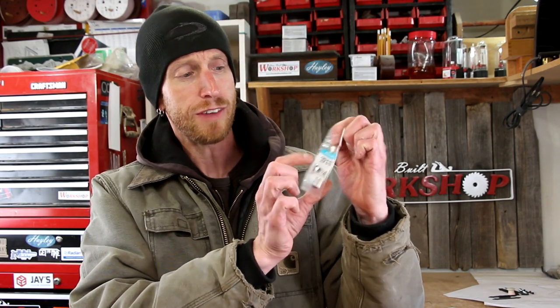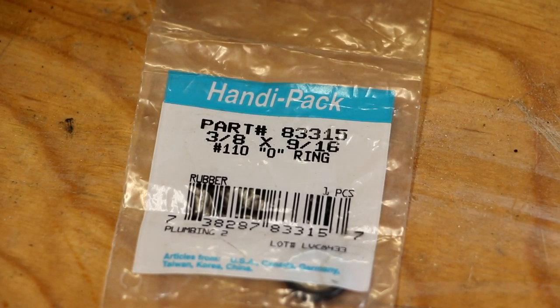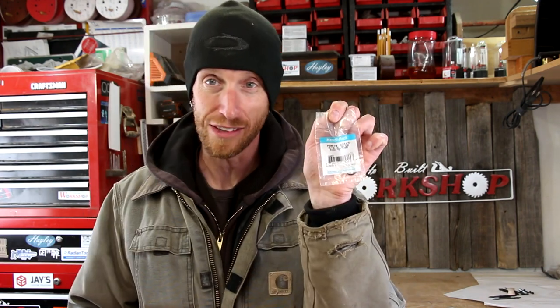To get my replacement O-ring, I went to my local hardware store and tried to compare and find the right one. I looked online to figure out the size but couldn't find anything. I ended up working with the clerk at the store — he was really helpful. We opened one of the propane fittings they had and took the O-ring off of that, then took it over to the O-ring bin and compared it against all the ones they had. What we found is that this is a 3/8 by 9/16 O-ring, marked as a number 110 O-ring. It looks to be identical in every way.